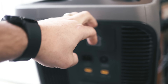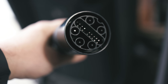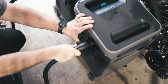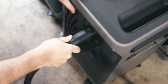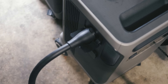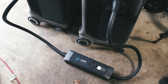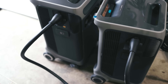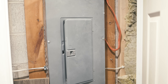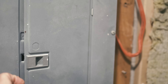Basically it's plug and play. You just open these up and the two cables on the double power hub — one goes into one unit, you push in and it snaps and locks in, then put the other end into the other unit. You're only going to be able to hook two of these up together, which is fine because you can still add expansion batteries if you want. Now I need to hook my double power hub into my inlet to run the power to the house. Before we hook this up, let's be safe and shut off the main power — we're going to flip the breaker and shut everything down.